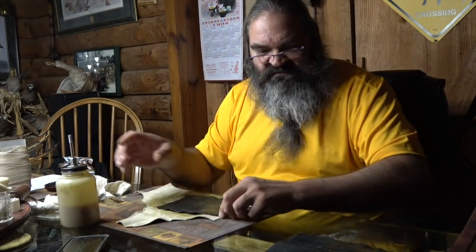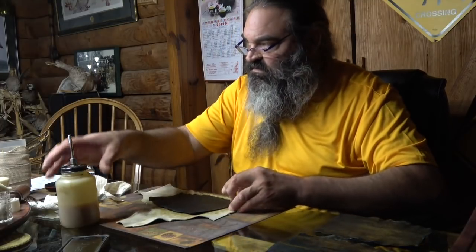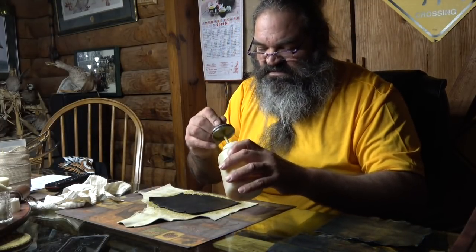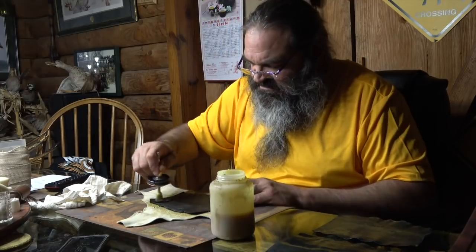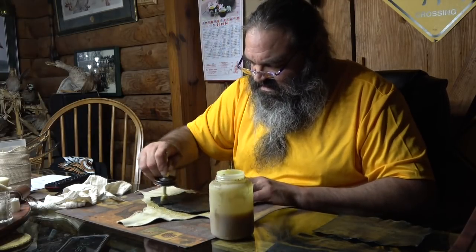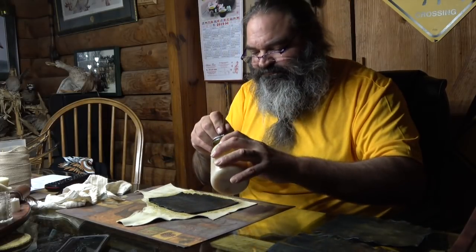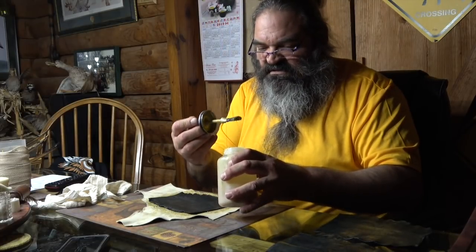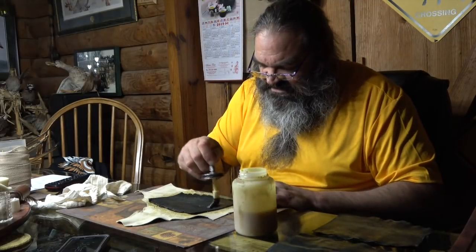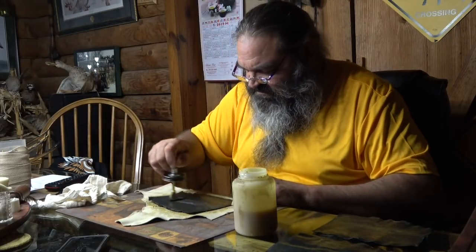And then I have to let it dry. But a couple of things that I've learned to make it easier since I've been doing this is to prep the tails. Each one of these tails that I'm spreading glue on currently, I've already got two coats of glue on them, at least. And then they were allowed to dry until I needed them, which could have been several days ago that I started this, or a week ago, or whatever. I let them dry generally completely, but you can also let them go for an hour or so and come back to them.